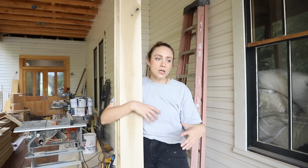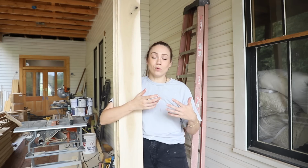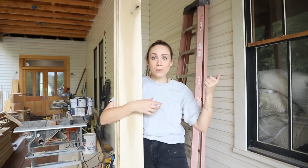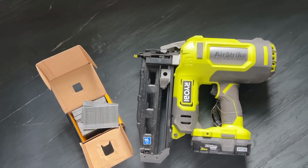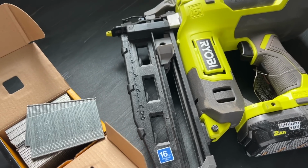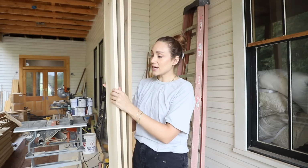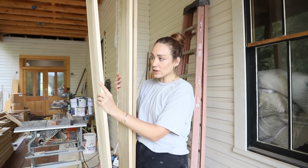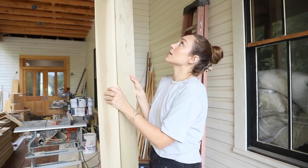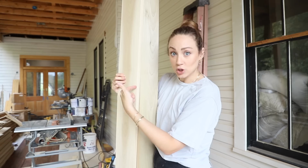It's not like the cabinets where they need to hold weight, like you're going to be touching them or moving them around. So I don't really need that. I can use my brad nailer with long nails, just like we did for the boxed windows. The easiest way to do beams is just to use boards like this, straight edge on the side, and literally just put them together, nail in. You could totally do that.